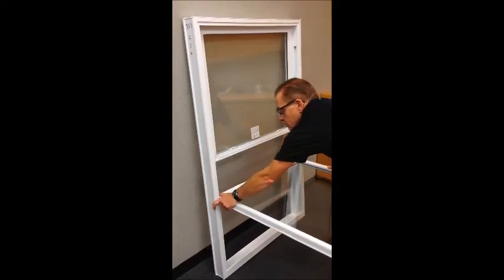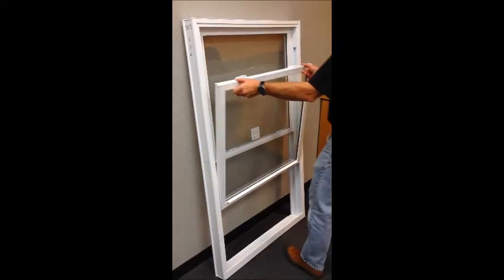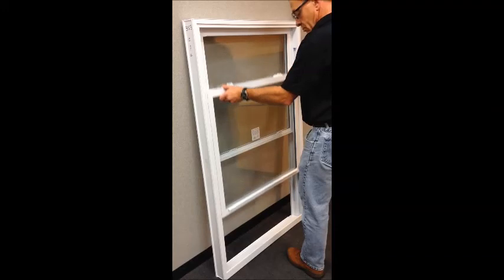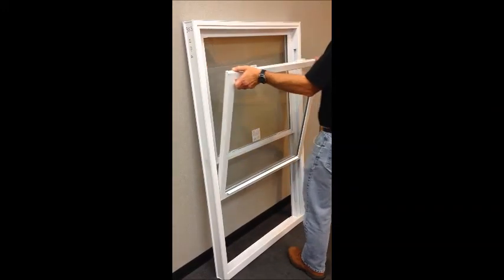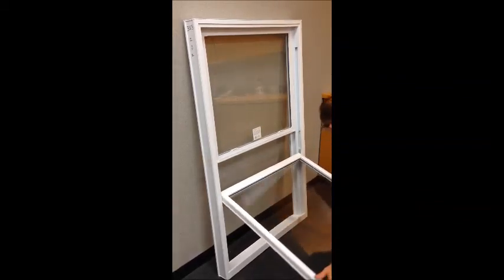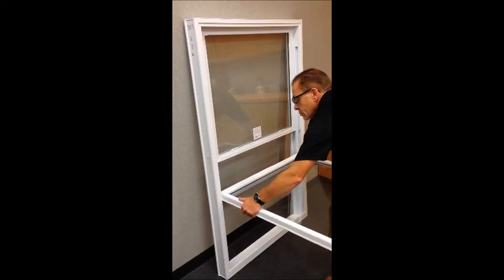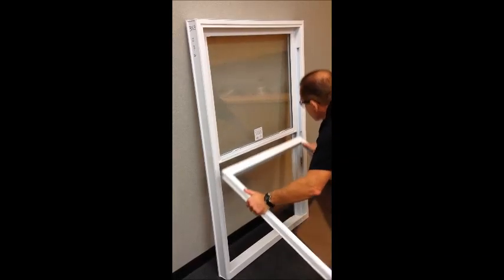Reinstalled, down slightly, square the sash, close and operate the sash, and I'll let our demonstrator go at a normal speed for taking that in and out. Remember, he's going to go past 90, come back up to it, and now it's a quick action. Down and out, clearing the opposite part and lifting out.